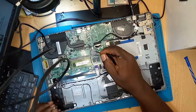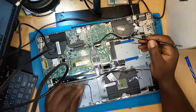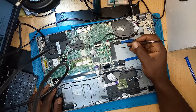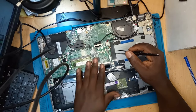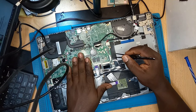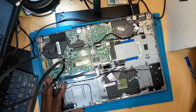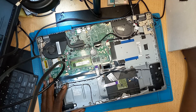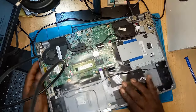Let me also try to reset the BIOS. I'm also suspecting the RAM here — I took the voltage and the chips are getting a little bit hot, but I don't know why. I'm getting no voltage on the RAM stick, but I keep getting higher temperatures on the RAM stick and the memory soldered on the motherboard. I really don't know which is which, but there's definitely some heat there — temperatures are a bit high.